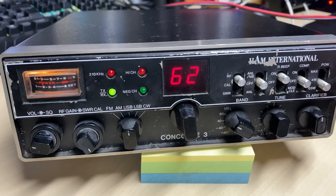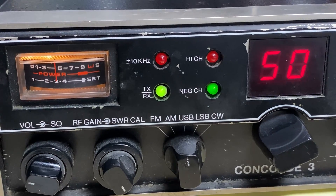I'm not sure whether that active ceramic filter is doing anything, but this thing's got really good receive — it sounds really well. I did a little bit of alignment on it, made sure the 10.695 MHz crystals were okay, and you can actually hear somebody on the negative channels as well, which is quite unusual. If anybody knows what language that is, please leave a comment below.